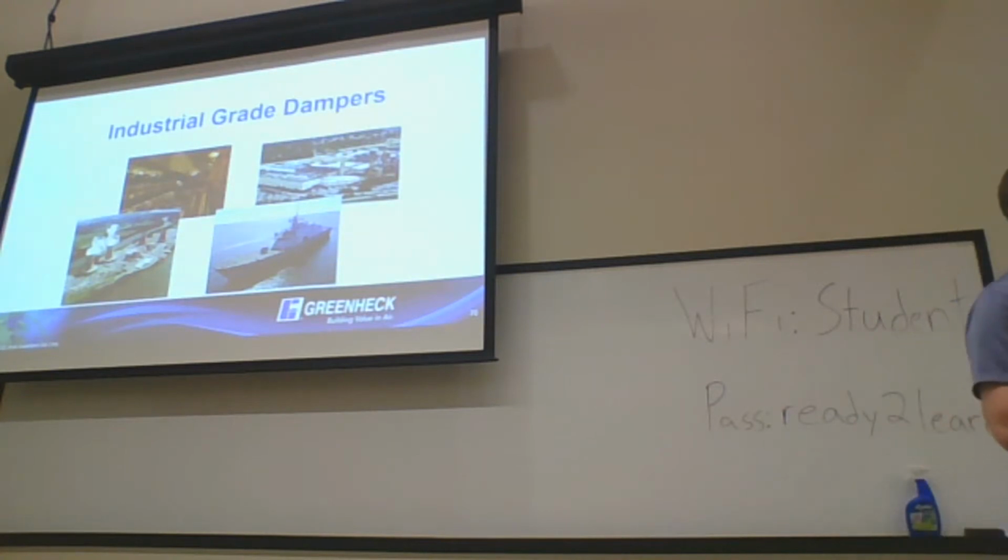Damper with the single retaining angle on one side. Is the installation what's certified to be approved for that, or is the damper assembly what has to be certified for that installation? Both, actually. Okay. So it's mostly the installation, but the damper has to be, and that's where the size requirement comes in. On the slide, as I mentioned, there's a reduced sizing, and that's because of the damper assembly size. Okay, so smaller is better.